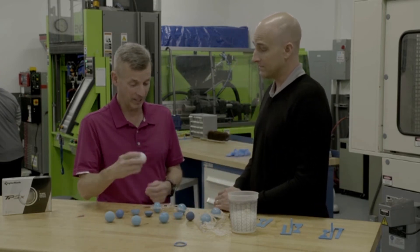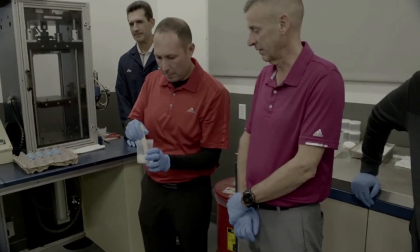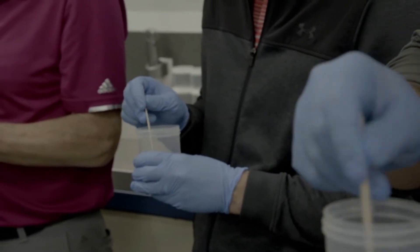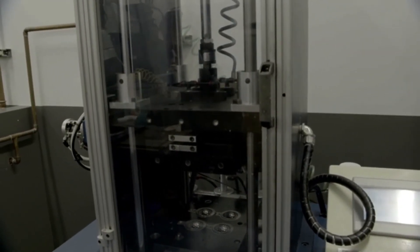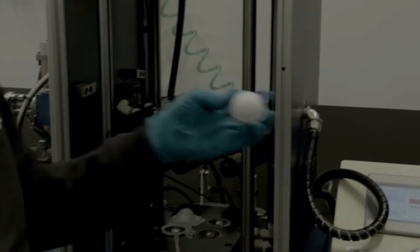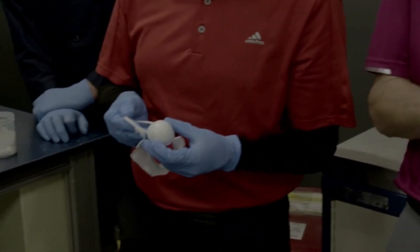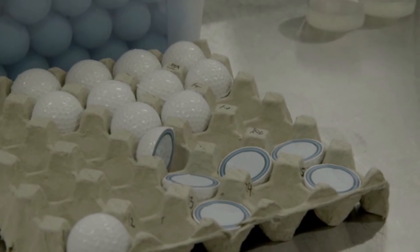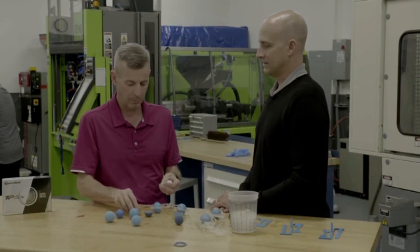Then next stage, you're going to put a cover on it. After the three layers, we prepare it for cast urethane. It's a two-part process — an A and B come together, get mixed, get poured into a cavity. We insert the mantle, which will ultimately form a part that will have some flash. That flash is removed with a seam buffing process, we prepare it for paint, and then we add several coats of paint. In this lab, you're making small batches, trying to test the next generation, using different compounds and different variations.